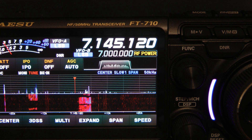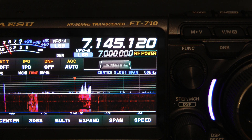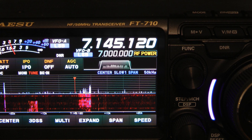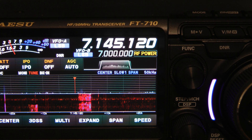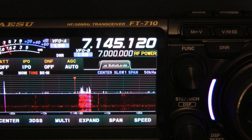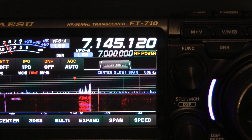Just to give you an idea of how you can cut out some of the noise with the RF gain: my noise level is about S2 to S3, which is a little high this morning. Normally I turn it up to a couple of S-units above the noise level, and that really helps with cutting out the noise.